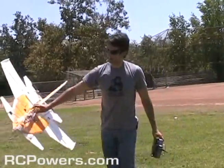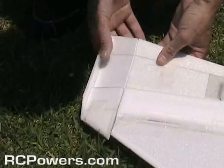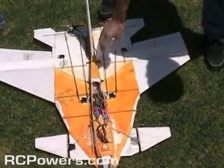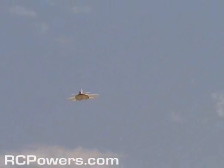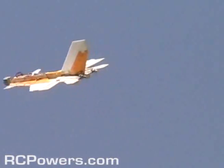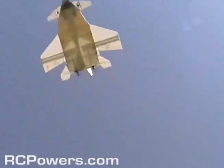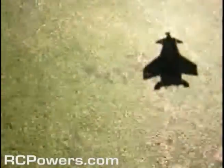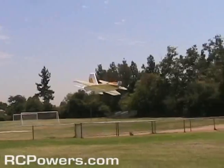I didn't wave to you this time. Alright, I wanted to try cutting a bunch off and seeing how this would work. Now I have a more narrow wingspan. Now it looks crilly — I know, it looks like a frog toad. Okay, that affected the CG. Well, it had an effect on the weight really. It's affected where the plane is getting its lift — I'm now getting less lift in the back and more lift in the front comparably. So it's wanting to nose up a little bit. Alright, try the high alpha. Not bad — wow, definitely not worse. That might possibly be a little bit better. Hard to say, but it's not worse. I do have a center of gravity issue because I've lost that lift in the back.